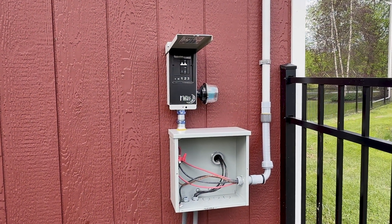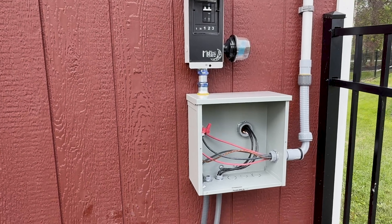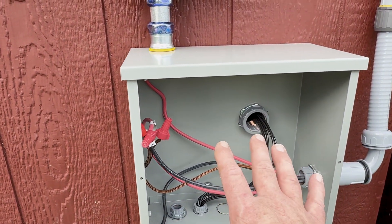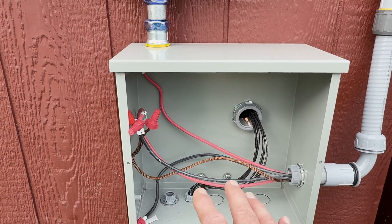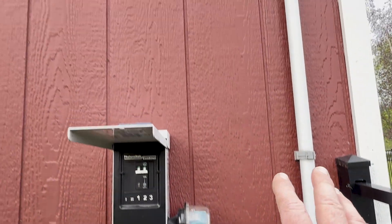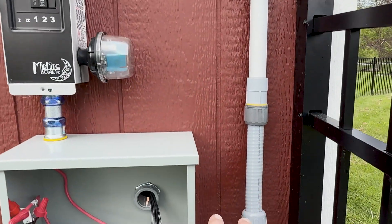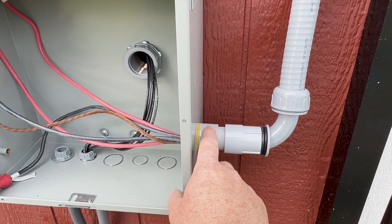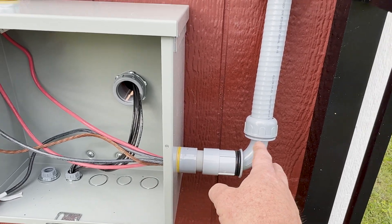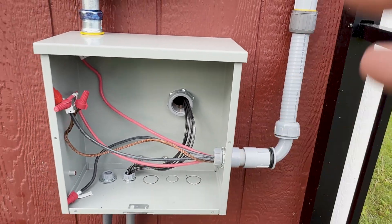Behind the shed, I want to show you what I've been working on for infrastructure since digging the trench. Went ahead and installed a 12x12x6 pull box. I really love this because it's large — I can fill it with cables and plan for the future. Went ahead and connected my existing solar that comes off the roof — I have six panels up there. Used the Harbor Freight punch-out tool to put my own knockout here, connected with a little flex. That's working out really well.